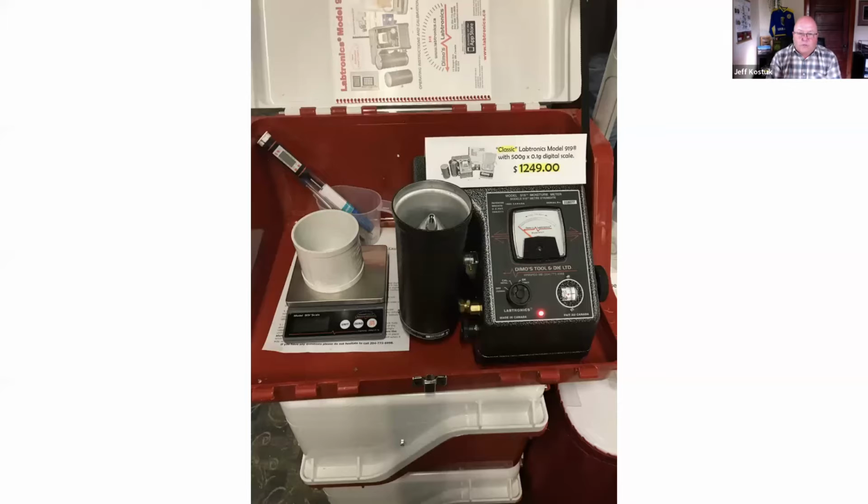A very important aspect when you're harvesting grain is a proper grain moisture meter. You want to make sure that you're not trying to use a setting for a crop that you think is similar. Make sure that you have a machine that will calibrate towards hemp and hemp alone. An example of this is a 919 moisture meter, which is the most popular in Canada.